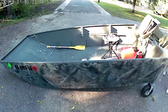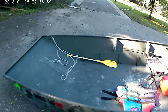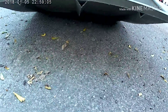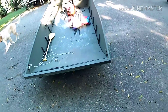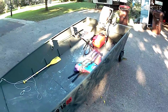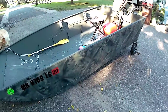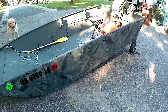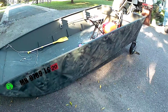Why that was a bad idea is because it allowed the metal to twist and contort a little bit, and the floor — the bottom of the boat — was no longer flat. When I went to weld in all these support stringers along the sides and the angle pieces on the bottom, it wasn't flat. I ended up having to use a hammer to beat the bottom flatter. That worked for the most part; however, the bottom ended up being a little wavy and not 100% flat, but it's waterproof and it floats. Is it perfect? Absolutely not.